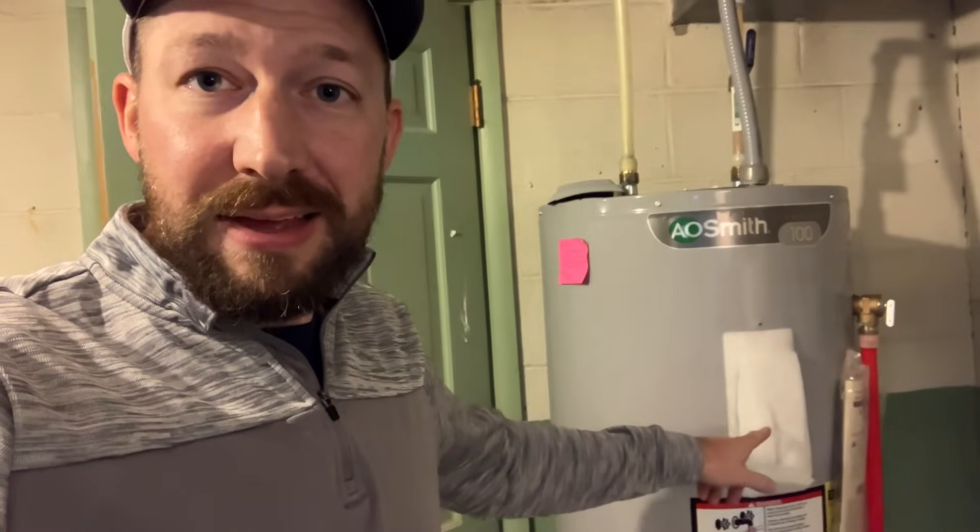I have always thought that when you have cold showers it's because you don't have enough hot water, or your hot water heater is old, or someone takes really long hot showers. But the truth is you probably have a bad heating element in your upper unit and you need to replace it.